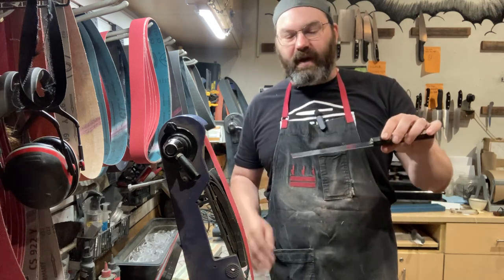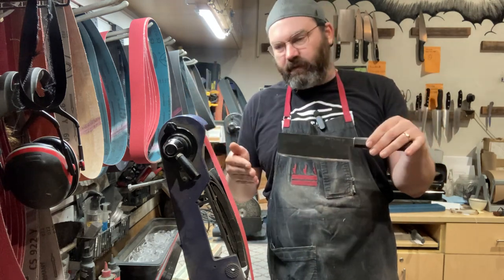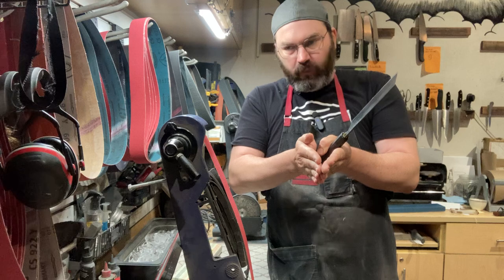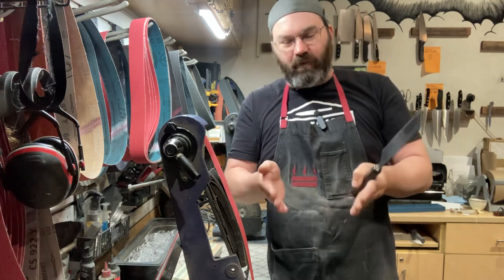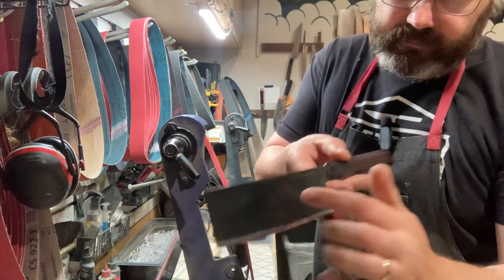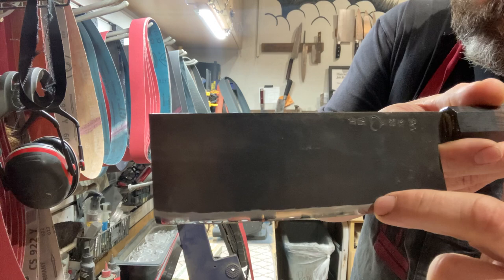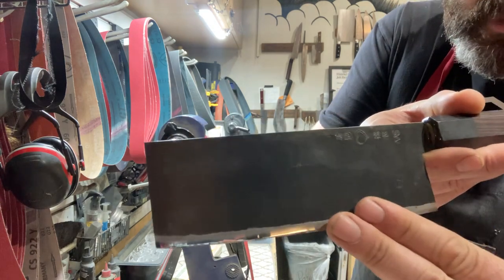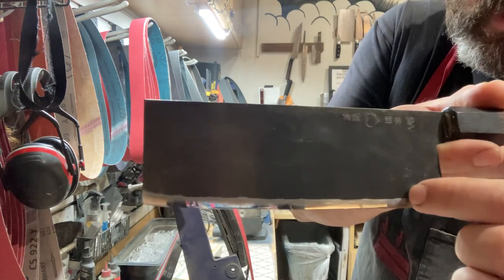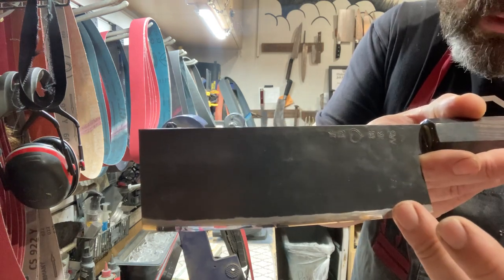So what I'm gonna do, this knife has right now what they call a scandi grind. Scandi comes from Scandinavia. It originated in Scandinavia for some reason, I don't know. Basically one giant edge, no little primary secondary edge geometry. One giant primary edge, which is a wedge. What I'm going to do is knock this shoulder off right along this line, bring that up, trying not to scratch the blade. That's going to raise up the shinogi here, bring it up this way, and then I'm going to put traditional primary secondary edge geometry on here.